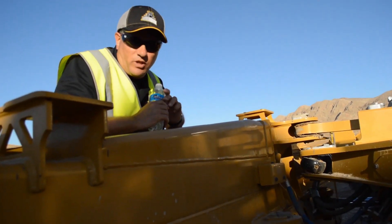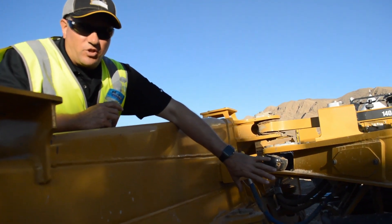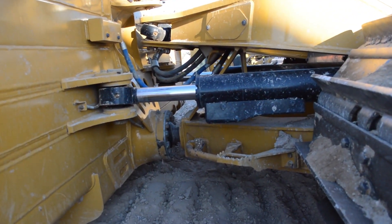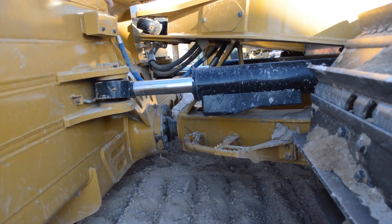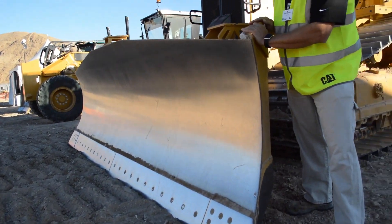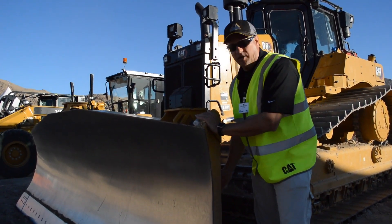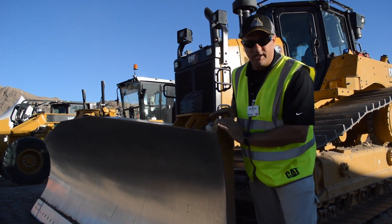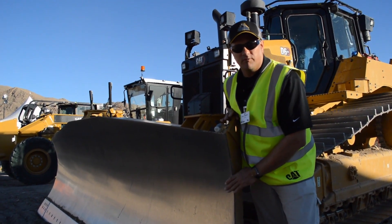One of the biggest visual improvements on this tractor is our brand new VPAT blade setup. We've changed the way the C frame is designed and now have a lower C frame as well as an upper C frame. We've essentially made this system much stronger than before but also much lighter, which helps improve our balance and finish grading capability. We've improved the blade and C frame by adding cells right where the angle cylinders attach — beefed up the blade where it needed it, shaved the corners down slightly, and improved the capacity and width of the blade for a truly amazing C frame and blade system for a VPAT dozer.